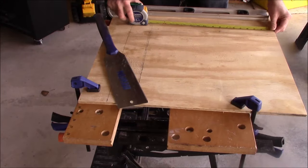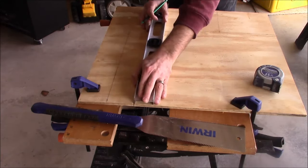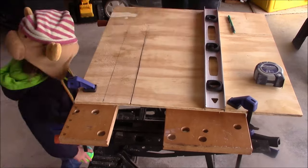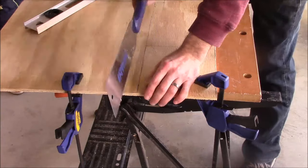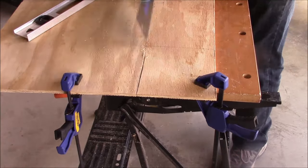I'm not sure about the thickness. This was 3/8 inch thick plywood, but otherwise I'm still drawing a little bit on my cutting list there, but it's just get to work, start cutting it up. The Japanese saw is really nice for this because you can almost go horizontal as you're pulling it and just keep your kerf, you know, stay to your line really, really well. It cuts pretty fast.